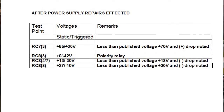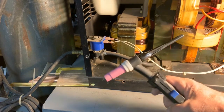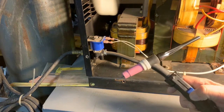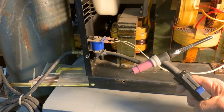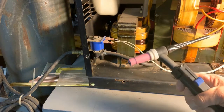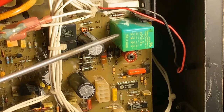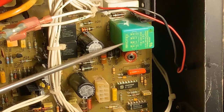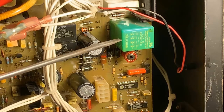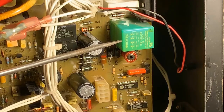There's one other thing that should be confirmed before we go much farther — most of the circuitry is working. I just want to confirm that the gas solenoid is still working as it should. A simple test would confirm that. And it is — you can hear it. Just check the basic functions before you go too far. The goal of all these exercises is to get back where we'd been with the polarity relay — it's got to be singing. It's not singing right now due to other problems on the board, but that's our goal.